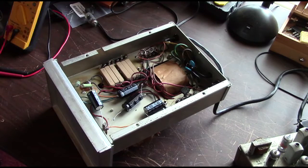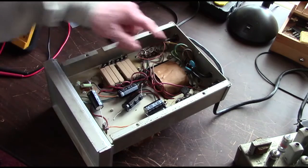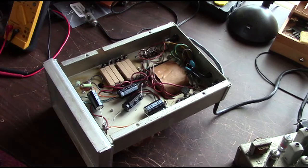Okay, this is the power supply and speaker that goes with this National NCX-3HF rig. As you can see, we have replaced all the filter capacitors, replaced a few other things, and tested everything else, so the power supply should be working well. We did try to test earlier by having it connected to the rig, and when we turned the rig on, the fuse on the power supply went pop. When we dug into it, we found that one of the silicon rectifiers was bad, and there was a 30-ohm power resistor in a spot where there should have been a 30k-ohm power resistor. We have replaced those and put a new fuse in it, and we have not powered it up yet — that's what we're going to do today.